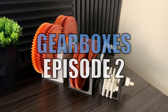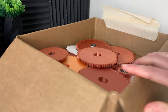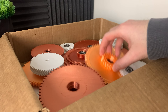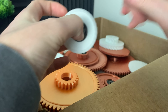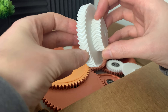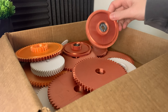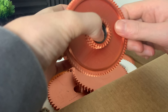In this series we'll answer those questions and more. As you can see, I've 3D printed quite a lot of gears and gone through quite a few iterations — I've tried larger gears with larger teeth, some double helical gears, some thinner gears with medium sized teeth, and a thicker gear also double helical. This one's actually injection molded — not sure how that ended up there. But after all of that, I ended up going with my original design because the smaller teeth have significantly less friction.